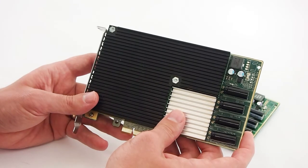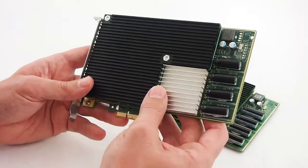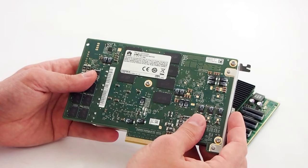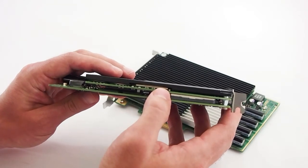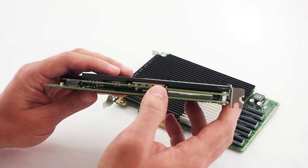The Huawei design is pretty unique in that it uses three controllers and joins two PCBs together. The main board features the PCIe interface and a single controller with its pool of NAND. Swinging around to the side, the daughter board, sandwiched in between the main board and the heatsink, contains the second and third controllers and their associated NAND pools.